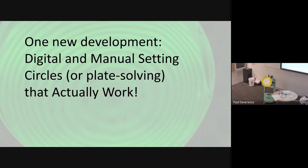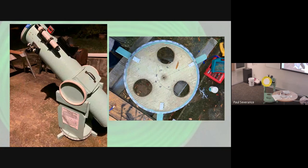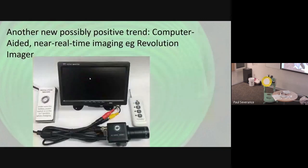Go ahead. Ah, here's me doing the getting the angles correct. Make a straight line. Make a perpendicular using compass and straight edge construction from geometry, also use the right angles, and then bisect those angles. So now I've got 45 degrees, and then measure very carefully along there how many millimeters that is, and divide that by 45 and figure out where 10 and 20 degrees would have been there. That was more than a little bit of work, but not very much fun. Next slide.